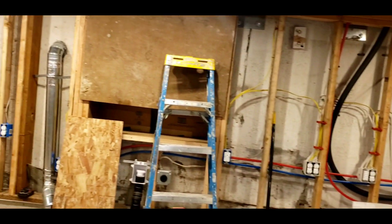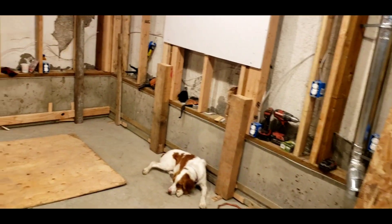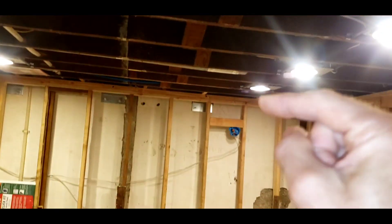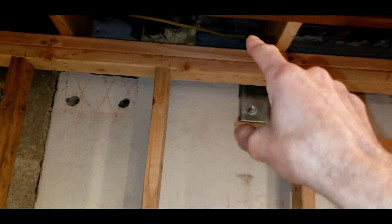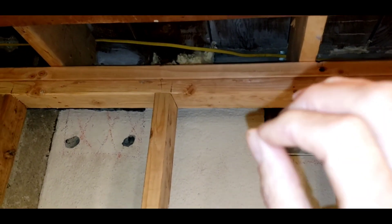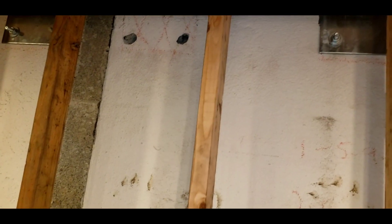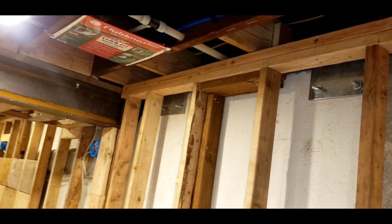So that's what's going on in the basement. You saw the insulation — that's next. That fireproof insulation gets stuffed into all the wall cavities, even up into the empty joist bays. It has to be completely fireproof so fire can't rush behind the wall where a fireman can't put it out. That all has to be inspected. We have four more inspections before the basement is completely done, but we're getting there — we're really getting close.